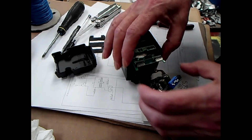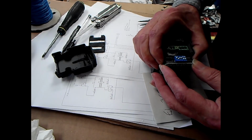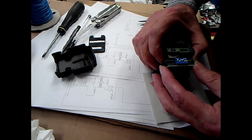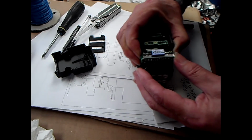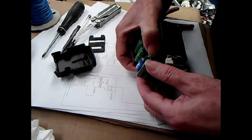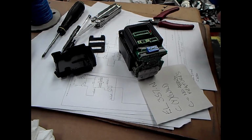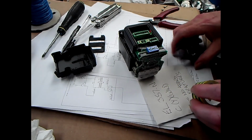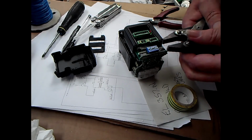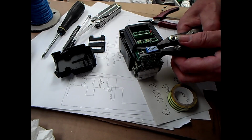It's a knob that you turn for whatever speed you want, and the instruction following that is M03, which means turn on spindle. So the L-box has power again. Now suddenly power is restored to the L-box and the PIC. So the L-box gets power for circa 20 to 200 milliseconds, loses power for a number of seconds, and it is then restored. Now, how good is the PIC at surviving this power glitch, or should we initiate a fresh start at this stage?